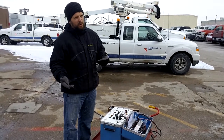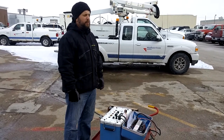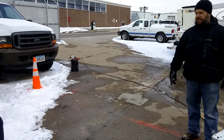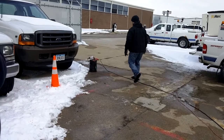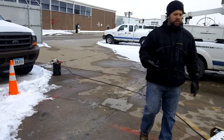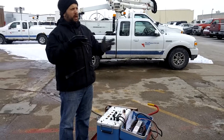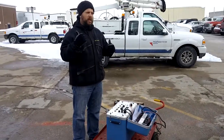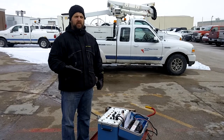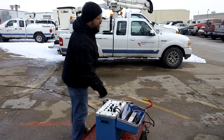You can skip high pop mode if you want, but if you're unsure if that's a bad cable or not, it doesn't hurt to hook up your leads, turn on high pop mode, and see if it holds all 10 kV. The way we've got it hooked up: the green is to ground, black is to the neutral, and red is high. If you're hooking up inside a transformer, you'd put your probe in and hook up to the probe with the red lead, hook up to the neutral, and hook the ground up to a ground rod. The ground is only used to disperse off any energy that's left in the machine — so when you hit stop ground, it has somewhere to go.